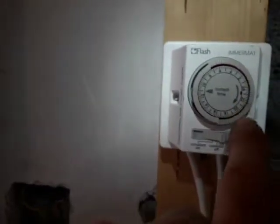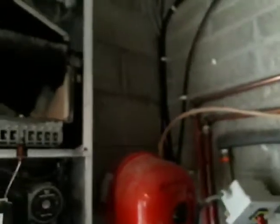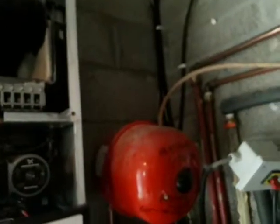It's wired through the heat pump, so if the heat pump is doing a hot water cycle — which will only last half an hour — it'll switch off power to that pump. The general guideline with this timer is to leave it on for more time than you think you need, because inside the stats will turn off each zone. I've set it to come on at 17:00 in the evening and stay on all night — it's cheaper on night rate until 8 in the morning. It won't necessarily be heating except in open zones when a stat is calling, but if a stat is calling and the timer isn't on, nothing will happen. You'll see the little red light on it when it's on — that's the timer for the underfloor pump.